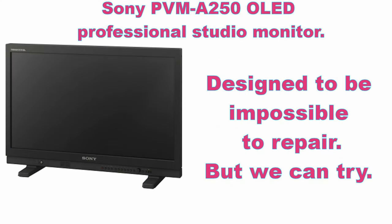This is a continuation of a video I did a couple of weeks ago about a Sony professional OLED display, PVM-A250, which has a service manual only for part of the electronics, and that part appears to be fine. There is no service manual for the electronics that actually drives the display. I had come down to a particular IC — a TPS54040 regulator — which wasn't outputting a voltage. Its enable pin was being disabled, so more likely the part is fine but it's not being told to run, though I hadn't absolutely proven that.